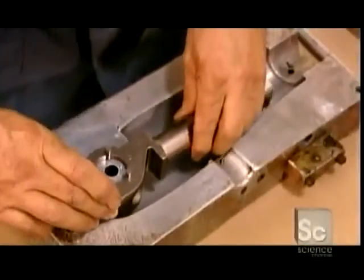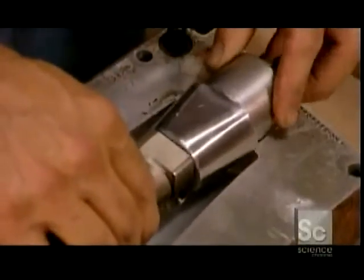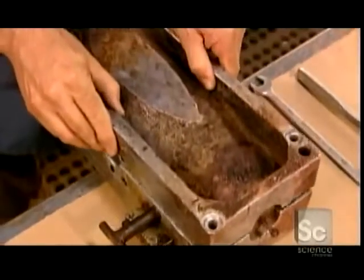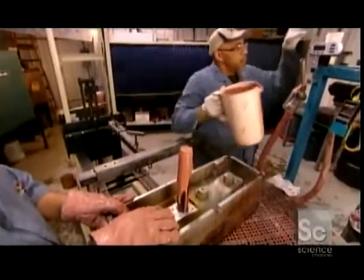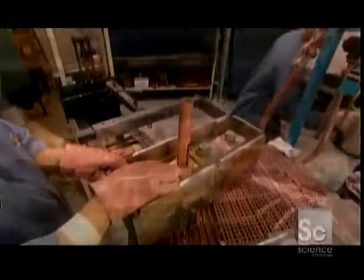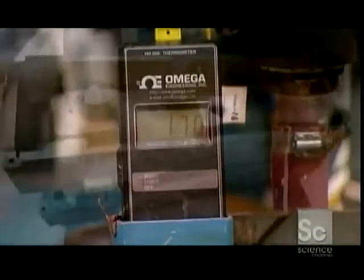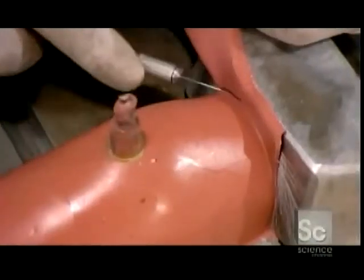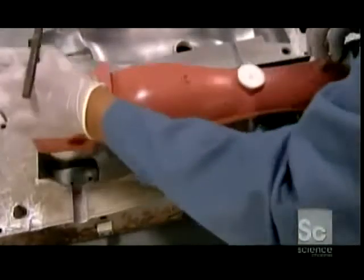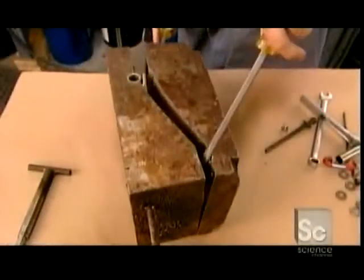The long bones and load cell forms are inserted into aluminum molds. Workers then bolt the molds shut and pour in liquid vinyl. The molds bake at around 350 degrees Fahrenheit for 10 to 20 minutes. When they come out, workers cut away any flash, the excess vinyl that oozes out during the baking process. Then, a technician inspects the components to ensure an accurate fit.